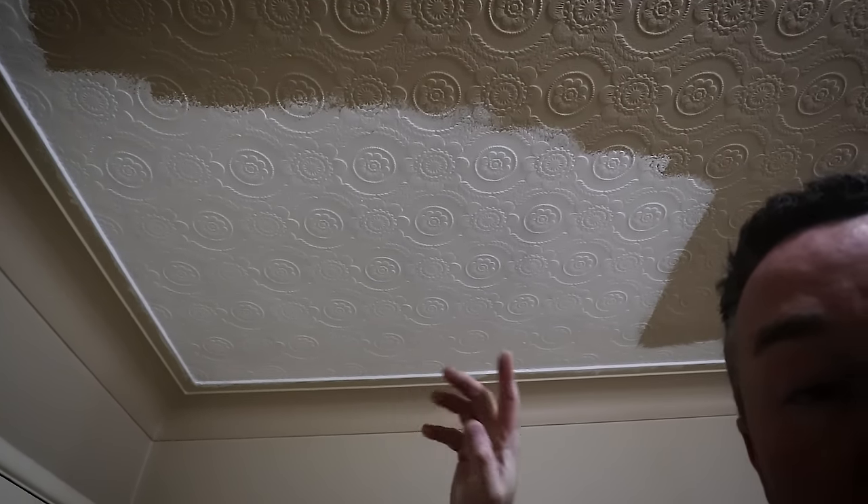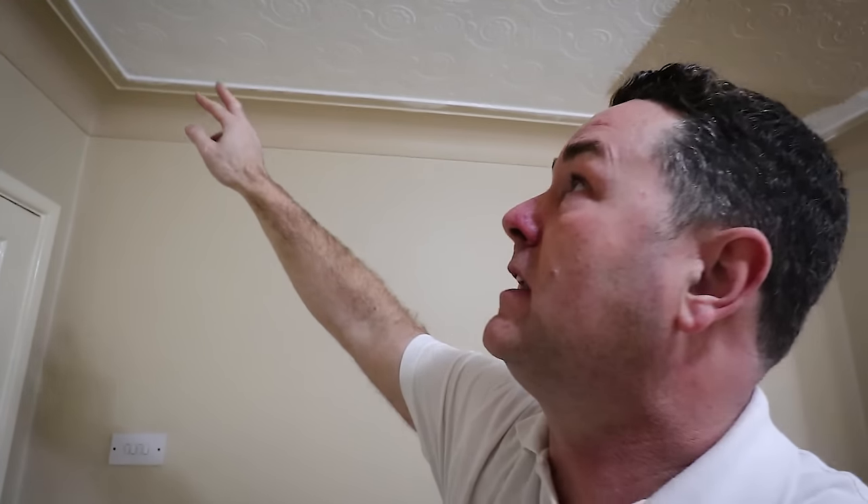Look at that - that's pretty good. That's one coat now. Once that's dried - it says four hours recoat time - it'll have a second coat. I'm hoping going over itself it'll apply a little bit easier; if not I might just put a tad of water in it. Looking at how it grins slightly on some of the relief round there, I might keep it straight out the tin. Give me twenty minutes and let's get this ceiling rolled.